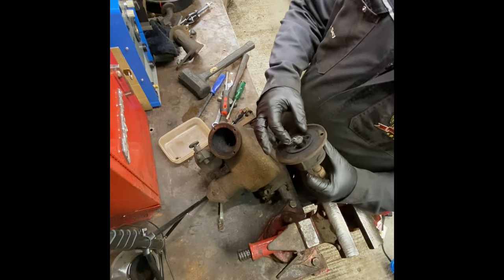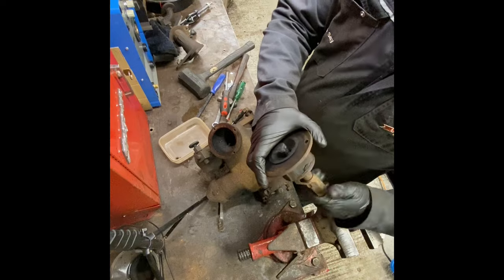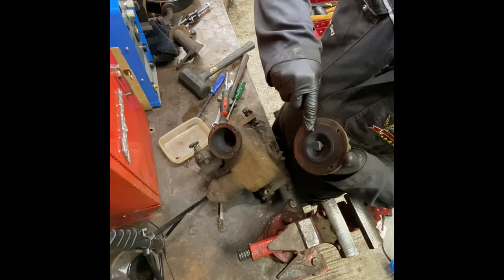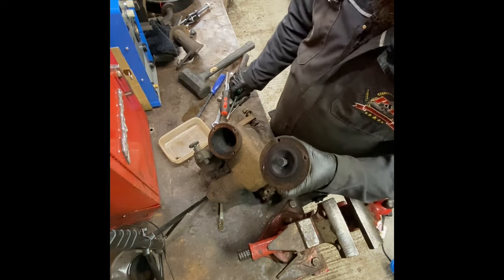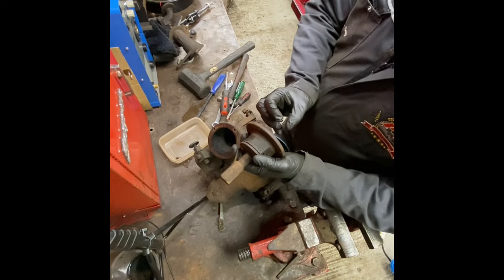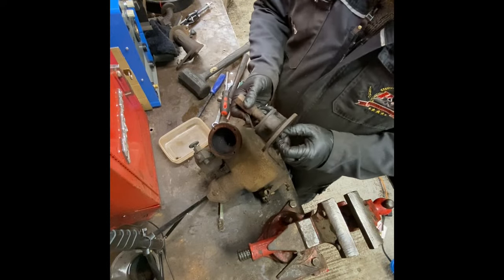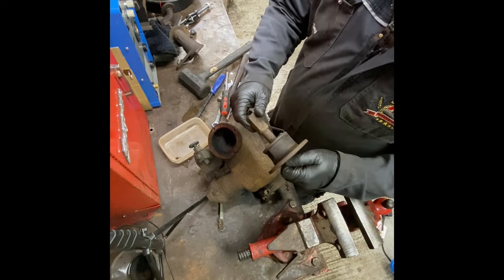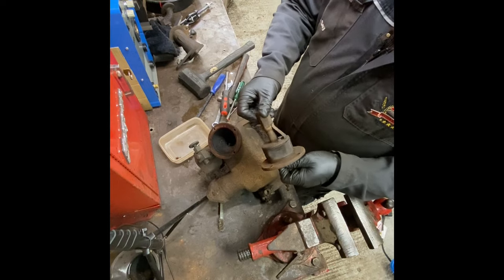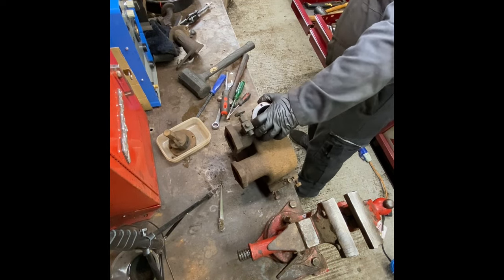There's the inlet valve. That's what happens here. Out of this spring, get some bloody cobwebs off. So you wind that up in and out, and it takes the pressure off this valve. Should be able to open it. That's a good job. I took it to bits because it seized. So that there is a valve held tight by that. When the engine runs and it wants some air, that valve clacks, which allows the air in and out. But obviously that's seized. There's a nice little wire mesh on there to stop debris flying in, but you can't get the bloody thing off. So cleaning it's hard work, and preserving it is also hard work. So it is possible. Done it before.